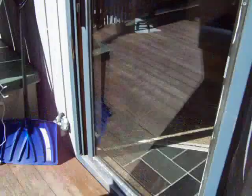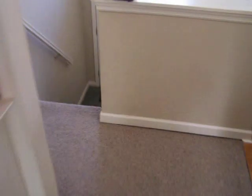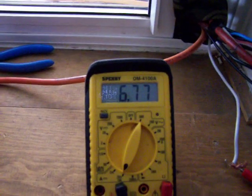Alright, let's take a walk inside and see if we can get some readings. Right now all my solar panels are hooked to my grid-tie inverter. I have store-bought solar panels also, and the DIY ones. The homemade panels are putting out 6.7 amps. The store-bought are putting out 8 amps. Both sets are going into this grid-tie inverter — 160 watts going into the grid right now.